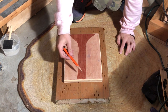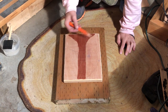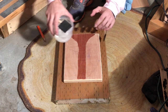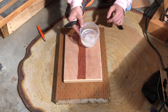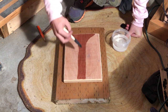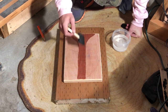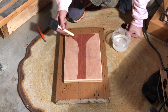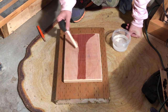What I've done now is taken my pencil and lightly sketched out the rough shape of the tree that I want to burn. Then I've taken my sodium bicarbonate solution — you can see some of it has settled out — and painted the start of my tree. I haven't done all of it because I want to direct my burn. You can see that the wet section is now the conductive section; the electricity will not flow into the dry side areas.